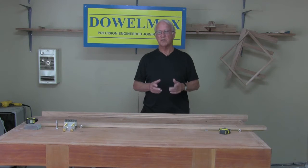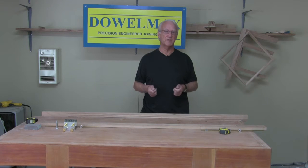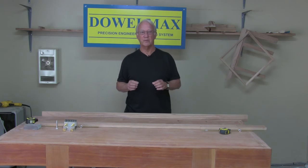Now we position and attach the rails to the fluted corner posts. There are 6 rails in total, that's 5 void spaces and 5 shelves. The upper and lower rails incorporate 3 dowels and the 4 inner rails incorporate 2 dowels at each joint. The upper rail is for structural purposes only.